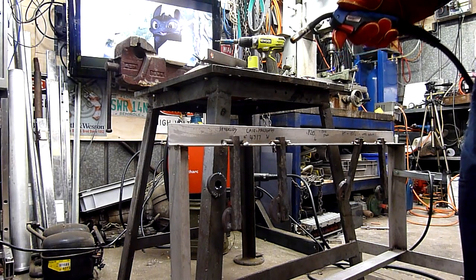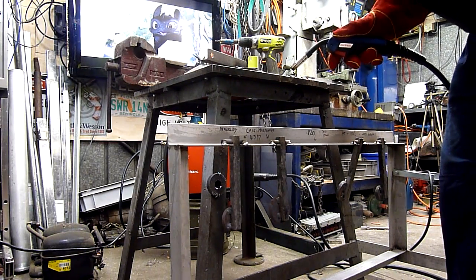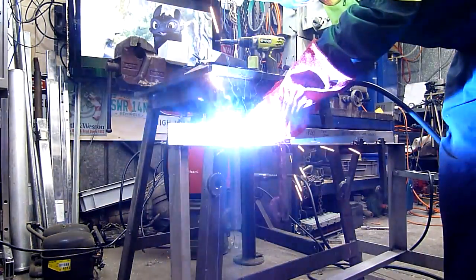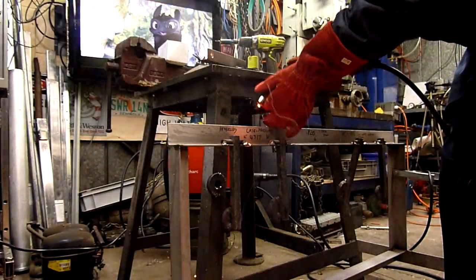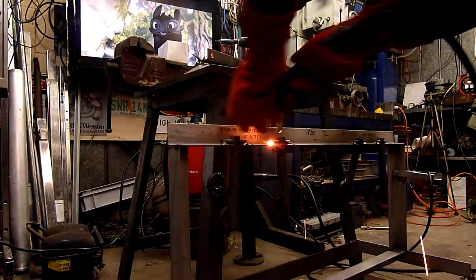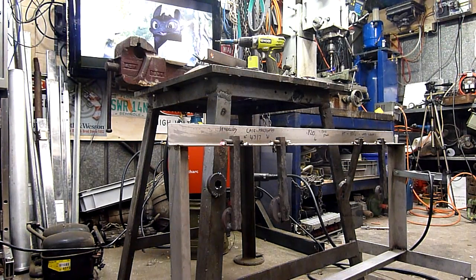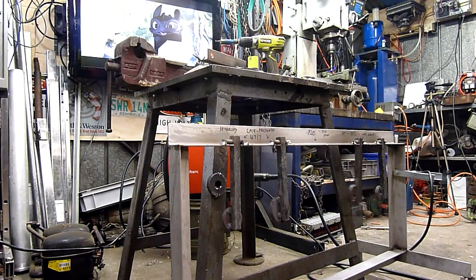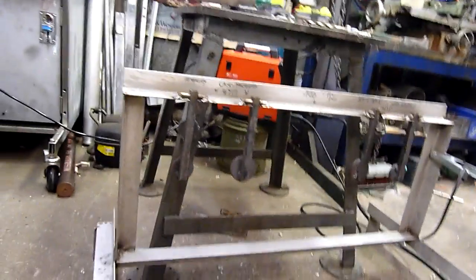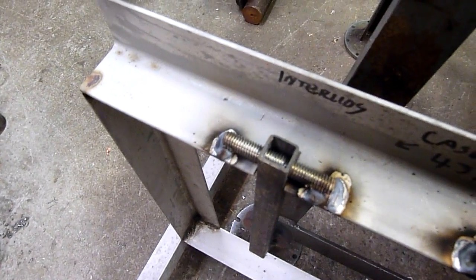I definitely need some Stain Shield, but I can only justify renting two cylinders if it's worth the $20 a month bottle rental. Not bad for what it is, but again I am running it wrong — I'm not using the right gas for it. The welds are coming out too hot and the wire is breaking too early by the looks of it.